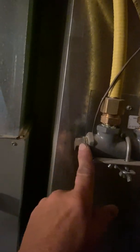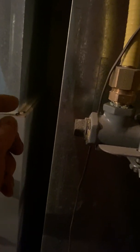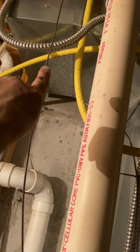Okay, so the gas line, Dallas will do the gas. Right now it's a 2-pound system and they have a manifold. So for him, he just needs a 3/4 inch close nipple and a 3/4 T and a 3/4 inch. You can just use this existing plug. And then a 3/4 inch fitting and flex. And you're just gonna go up the old duct chase to the attic.